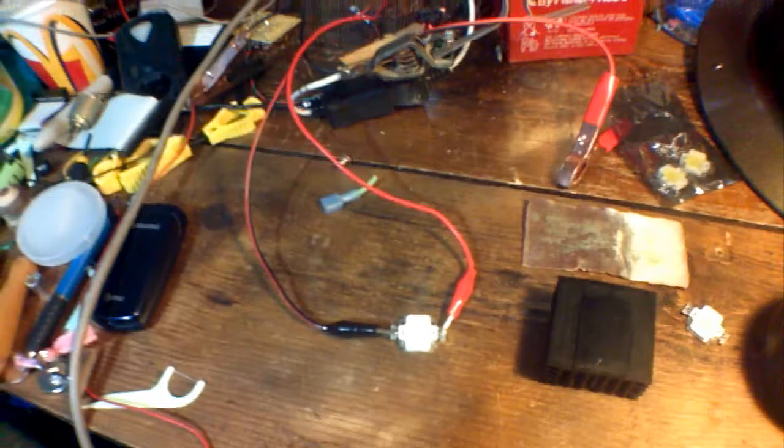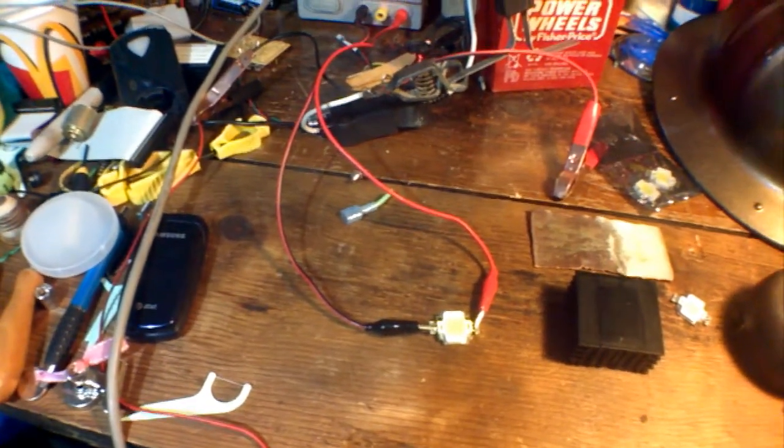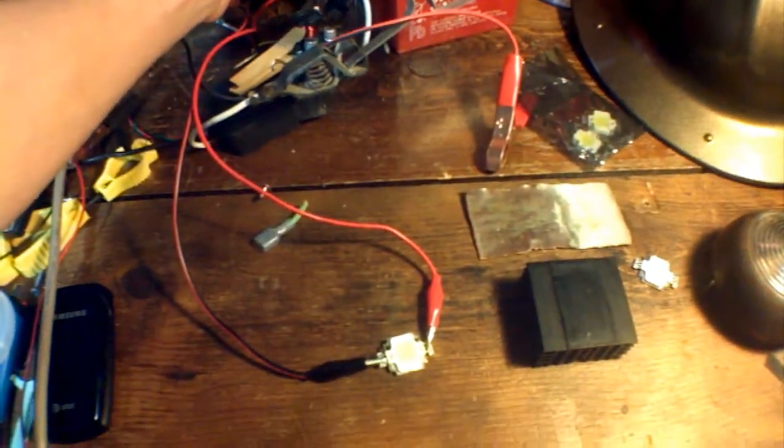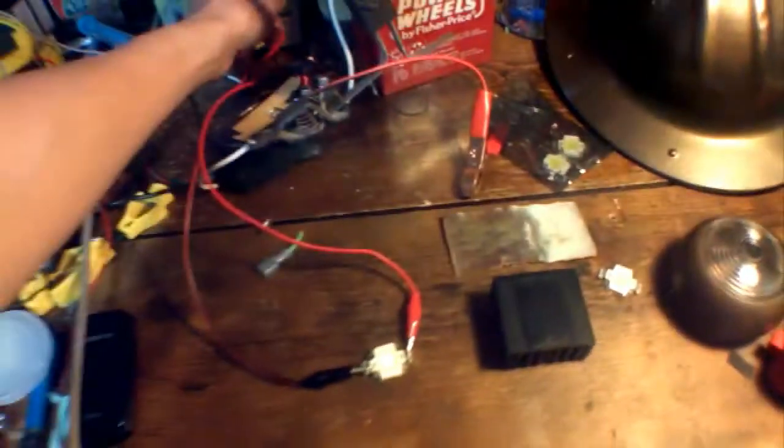I have one of these 10-watt LEDs hooked up, and even though they're rated for 12 volts, I might only run them at 8 volts because they're insanely bright even at 8 volts. And whenever you get them near like 6 volts, they start to kind of glow — it looks very cool. I think that looks pretty cool; it looks like Tony Stark's arc reactor thing for his Iron Man suit.